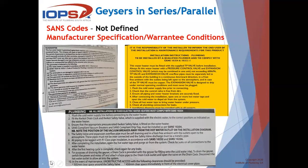Why are we looking at this today? One of the reasons why we have to talk about this is because the standard doesn't address it. While SANS 10252 and SANS 10254 — one very specific to geysers, one broader addressing all water installations — there are some references to multiple geysers being installed, but it doesn't tell you exactly what to do and how to do it. There are some principles to apply. This presentation tries to highlight the minimum requirements when you do something like that, and some practical considerations, because in this case the practical considerations are much more important than just trying to stick to the minimum requirements. You can potentially comply with the minimum requirements and still give your customer something that's not really going to do the job the way it should.